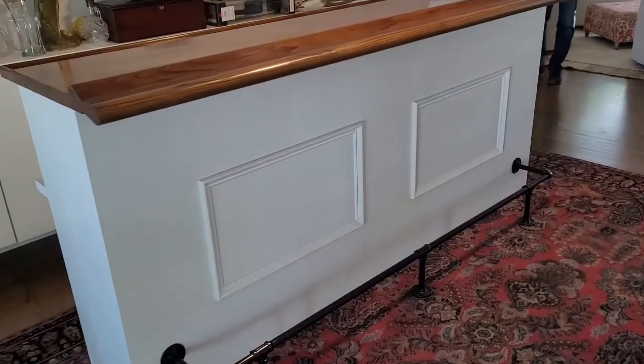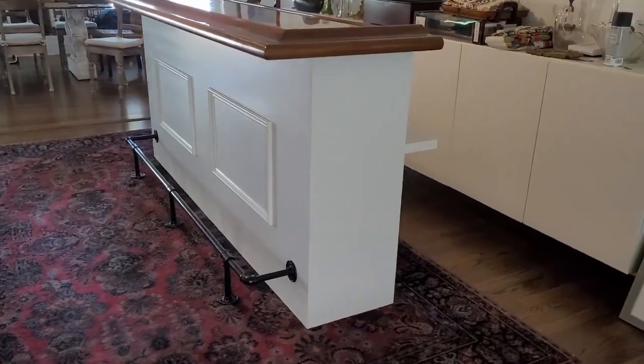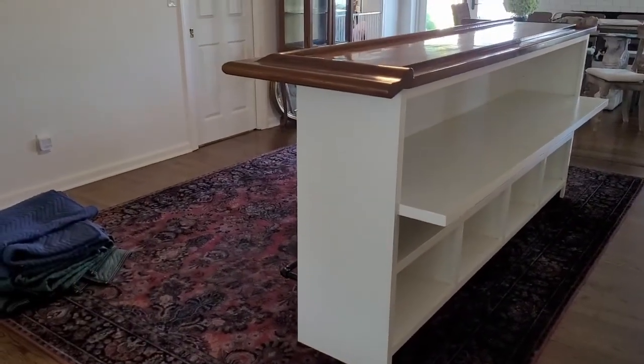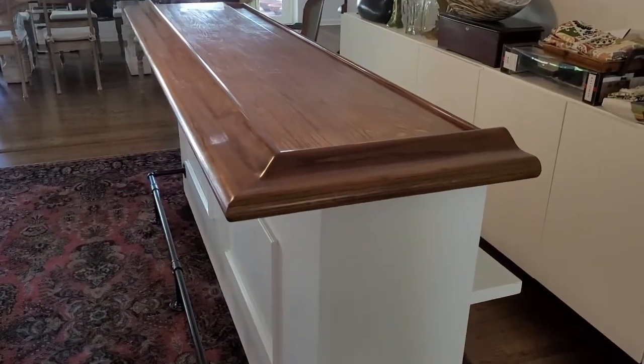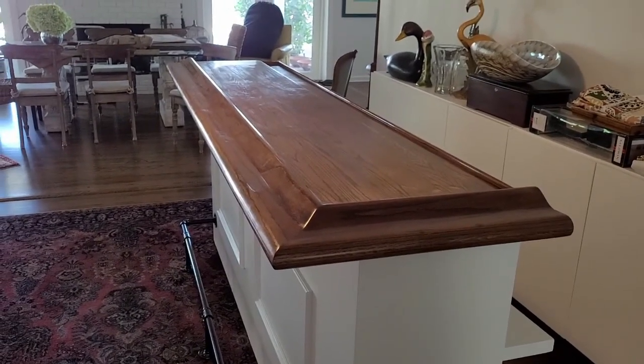The installation went smoothly. We carried in the body of the bar, the top, and the foot rail. I started by attaching the bar top to the top frame of the base with number 8 by 2-inch screws, then attached the foot rail using quarter-20 machine head screws painted black to match the foot rail, locked in place with washers and acorn nuts painted white — a little detail, but the fasteners blend in with the bar. This build was full of challenges: it was big, it was heavy, and the thought of messing up that bar rail scared me. I had several setbacks during the finishing process, but that's a story for another day.